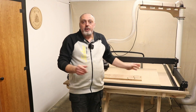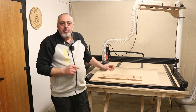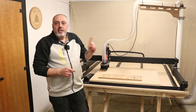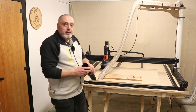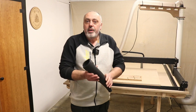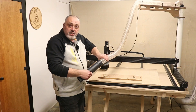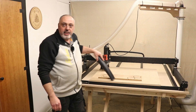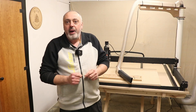I'm actually very pleased with the result of that test. There was virtually zero dust that actually escaped outside the dust shoe. You'll always end up with a little bit of dust down in the grooves of your project. So my plan is I can take the pipe off — I've actually found that a pipe off a leaf blower is a perfect fit for the 63mm flexible pipe. Now I can use it as a vacuum on any parts of the job where the dust shoe hasn't picked up the dust.